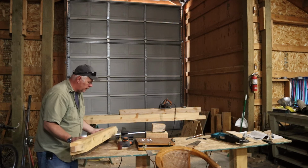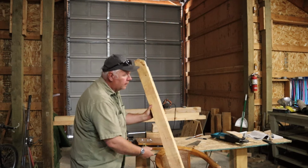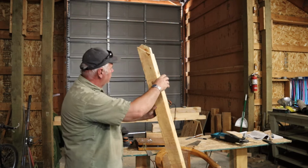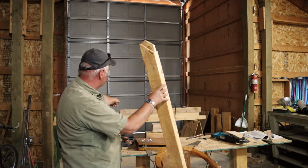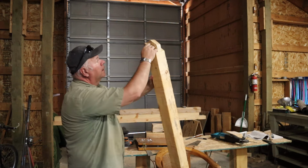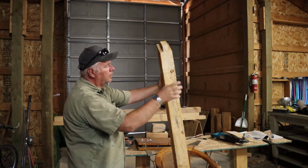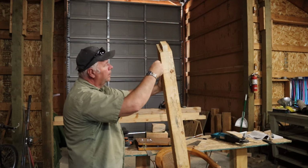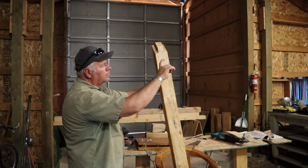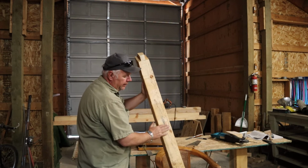And on the previous video, I said that on this one I will try to explain part of what I'm doing, and that's a knee brace. That's an example of a knee brace with the end. And what it does is, say you have a post, and there behind me you'll see a main header, and I'll put this in the main header in just a minute. And you've got to notch this out so that it fits inside that post. So on the post, you go 3 feet down, there'll be a hole. There's a 2-inch wide, 4 inches tall hole that this actually fits in. And I'm making some of these.